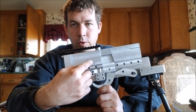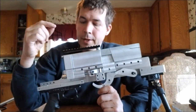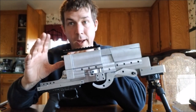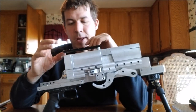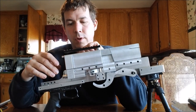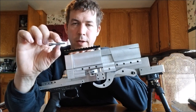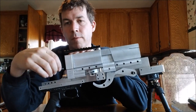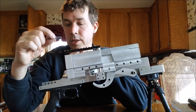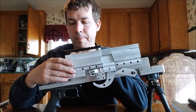Once the gun is under pressure, this is very hard to open — it can still be done but it's difficult. Now moving on to the main valve: this is the dump valve. There's a chamber inside here. When the gun is fired it's called a dump valve because it dumps all the air inside this fixed-volume chamber down the barrel. This back block is about three times thicker than it really needs to be — everything's extra heavy because I engineered this step by step rather than from a full CAD drawing. I've got four quarter-20 screws with heavy thread engagement — good for about 1,700 pounds each. At 800 PSI inside this chamber I'm only getting about 1,400 pounds of total force, so I have plenty of strength.